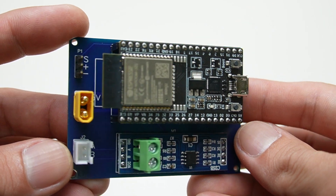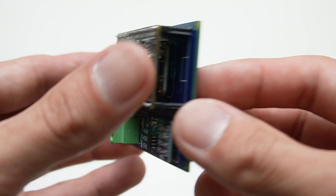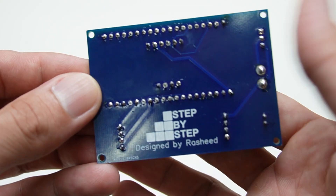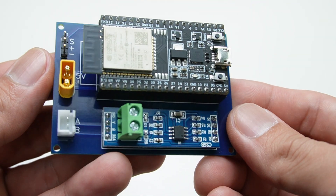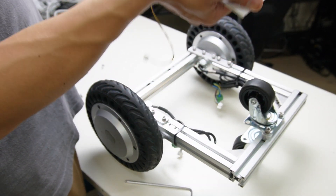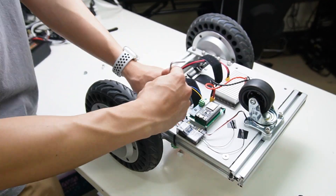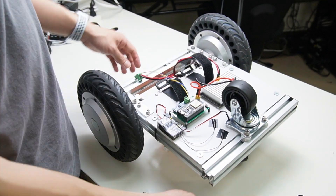After settling, here is what my board looks like. The ESP32 is plugged on top with the IMU on the bottom. Beside it is the TTL to RS485 converter board, and the XT30 and JST connectors are just what I needed. Everything is fitted and tied onto a white plate with screws, and this plate is attached to the robot base frame so it won't fly away when the robot is moving.